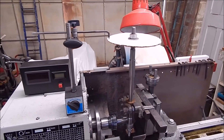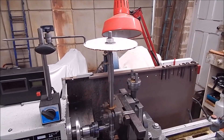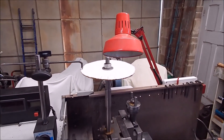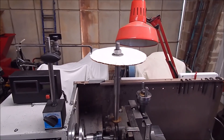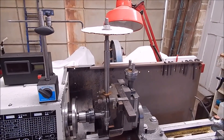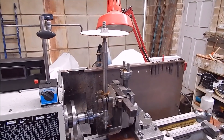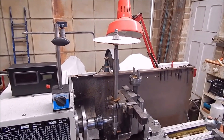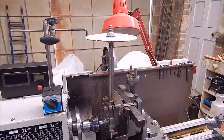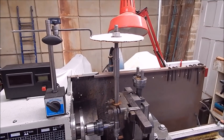Here's the final setup — you can see what we've done. Whether you use a pointer or a USB microscope like I intend to, you'll get a good result. If you use a pointer, use a magnifying glass just to make sure everything is really lined up. You don't need any fancy dividing head or anything like that — you can do it with just a plain old mill slide. Check out the webpage; the link is in the video description. Read all of those web pages and you'll be a dab hand at cutting gears because it's all there. Ok, that's it from me, see you next time, cheers.